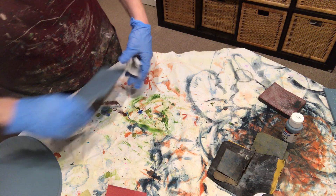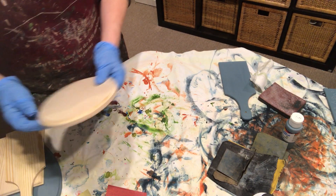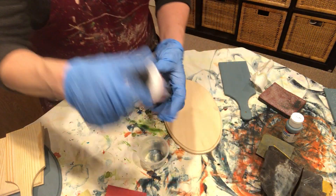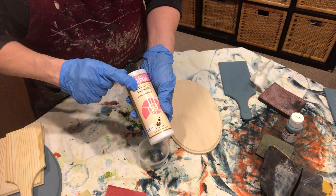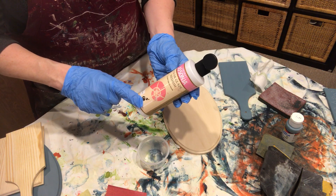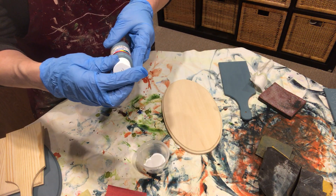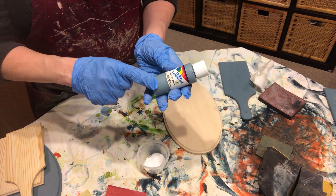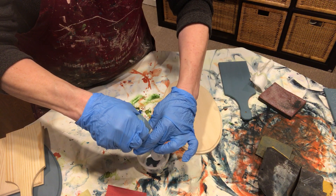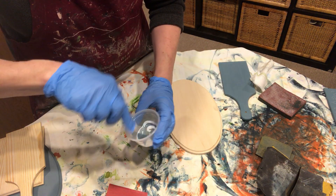Now, the other question people have been asking is: once I have things sanded, how do I put my base coat on? For myself, I use one part of Clear Glaze Medium — it's a light surface sealer from Jo Sonja paints with Chroma. I'm doing one-to-one with an old color called Blue Haze from Delta Ceram Coat. I don't even know if they make this anymore, but it's a color I really like, and I've actually gone to Sherwin-Williams and had them color match it for me.